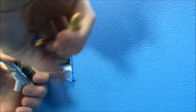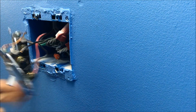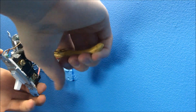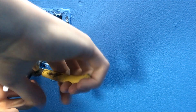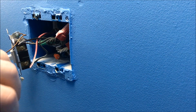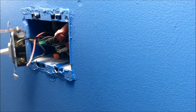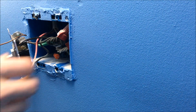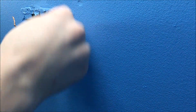The wires are on the shorter side, so just get a pair of pliers. You're supposed to insert something to release them, but I might just have to cut these really close to the back. The green ground screw was not even attached really well, so we're going to pop the ground wire off. There's your first switch. To make your life simple, just leave the other wires be for now.